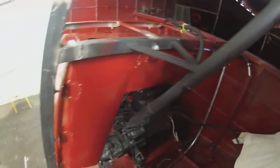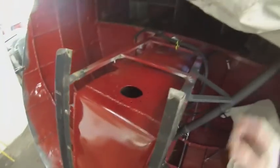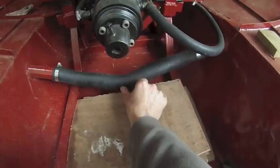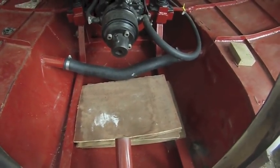This is where the fuel tank is going to go. The filler is right there, so I can rest a jerry can on top and just tip it over. And I'll have a tube leading up to the deck of the boat so I can fill it from up there if I want. Here's the outlet. You might have been wondering why I have these rubber pieces here — it was very difficult to get behind here with a weld. So the simple solution was to just seal it with rubber hose, and that works fine. Same thing here — I put a rubber hose there because trying to weld at the bottom of that V was very difficult. I couldn't get the welder underneath it well enough to create a watertight weld, so I just used a rubber radiator hose instead.